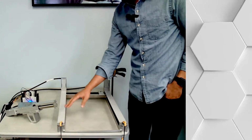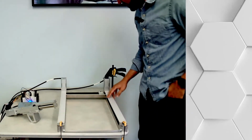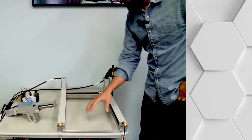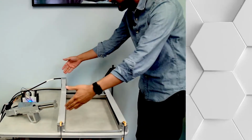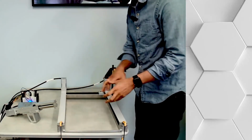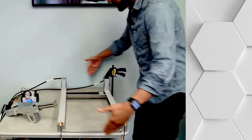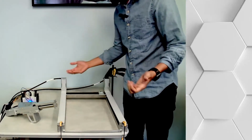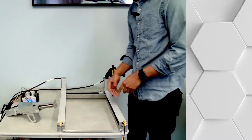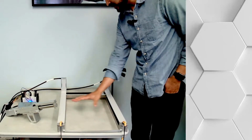So this is an H gantry, and basically this is the carriage, and it'll move along all of the surface, right? The beauty of this is that it is self-contained. So if you build a machine to manipulate something in this area, you would only need to build a machine around this gantry. Unlike a robot, where you have to secure all of the area around the robot depending on its reach, this is self-contained. So everything will fall into this area.